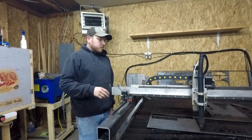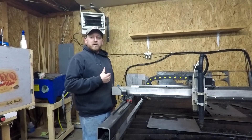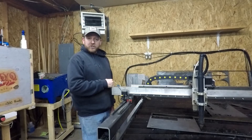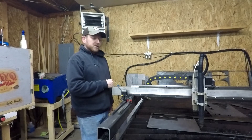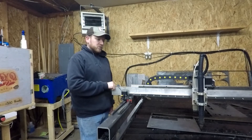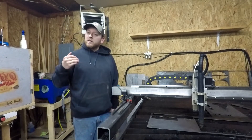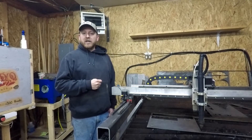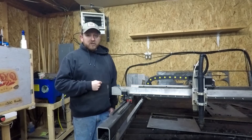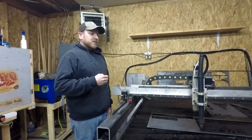I found that the 1.1mm, 60-amp consumables with the standard blowback-style electrode have worked amazingly well. On the current nozzle, I've cut a four-foot by four-foot sheet of quarter-inch plate, quite a few bottle openers at 10-gauge, and an entire sheet of leaves for a customer out of 16-gauge — all on the exact same consumables. With the hand torch I was just blowing through them, but to be fair I never tried the Tecmo consumables on it. If you're struggling with consumables, that is definitely something I recommend trying.